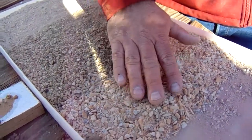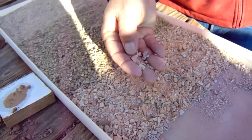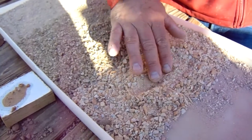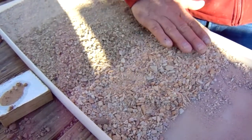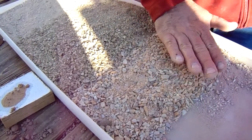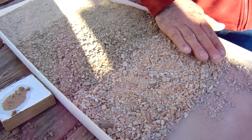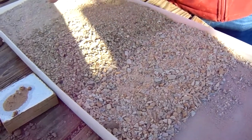The first material here is a crushed stone fine that's a 3/8 minus. This is called honey quartz. Some people call it Apache sunset. And we can see it's got lots of good stone chips in it, in addition to the rock fines. This is a result of crushing large boulders, and this is just the leftover dust, so to speak. This material packs down. It makes a very strong surface and is a beautiful kind of peachy gold color.